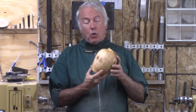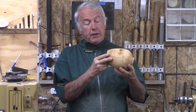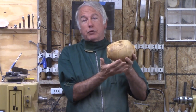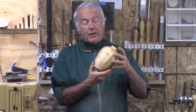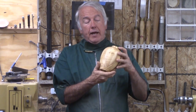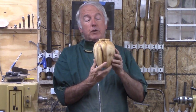The wood was interesting because I think it was more of a horizontal branch of the tree, because the pith or the heartwood was more offset. There was a lot more sapwood down here, which would tend to be on the underside of a branch. I think this base utilizes that to pull the heartwood figure off to the side and have sapwood more on the other side for a nice contrast to the olive wood.